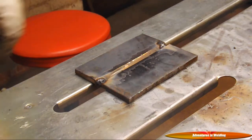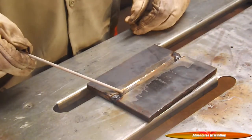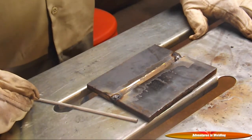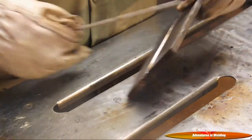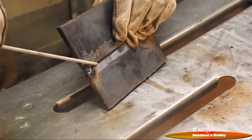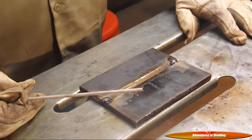Alright folks, what we're going to do here is to weld the back side of the joint from the front side. This is what you have to do if you're dealing with large box tubing or pipe, because there's no way you're going to be able to get your stinger and your rod inside there. So what has to happen is you're using that deep digging rod, the 6010 or the 6011, and you're going to shove it clear in there - as far as you can into the bevel. What's happening is it is spitting metal out. You're going to burn through that land and deposit metal on the back side from the front side. I know it sounds crazy, but that's the way we do it.